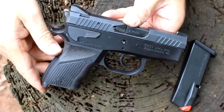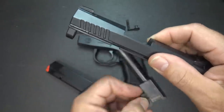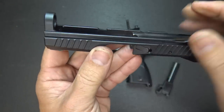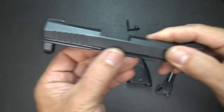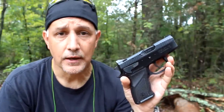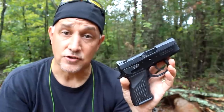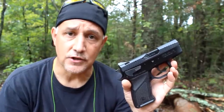With this pistol you're going to be ready to hit the range. The barrel is three and a quarter inches, using a solid link design rather than an open design. One of the big things about this design, shared with all CZs, is the internal slide rails — you have full rails on the slide itself. With a lot of newer polymer frame pistols you have little steel inserts, but this gives you consistent gliding on the frame. At the range it's really accurate, very smooth shooting. A lot of that has to do with the internal slide rails — low bore axis — everything you'd expect out of a CZ but on steroids, finally finished. Very tight and shoots very crisp.